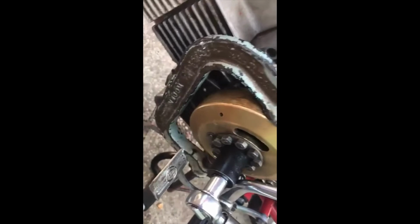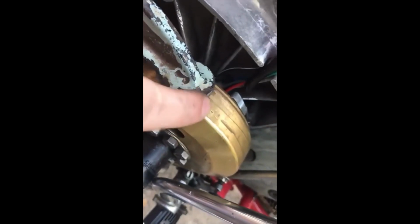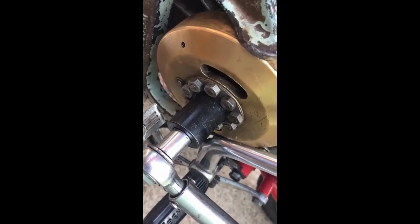Right, I'm tightening the flywheel up. I've got my torque wrench on there. It's set to 55 foot-pounds, and the method I use is I put a G-clamp on the flywheel, and then where the leg of the G-clamp comes down there, this bar is jamming it there so that this can't rotate, and then I can tighten the flywheel up. I find these G-clamps are really good for clamping the flywheels. You don't have to tighten them up, all you have to do is nip them up, and when you try and turn it, it jams. Doesn't damage the flywheel. Used it loads of times. So I'm now tightening it up at 55 foot-pounds, and then I'll run it and then try it again, because it's important that this is tight, because if it slips you can wreck the taper. It'll shear the woodruff key and wreck the taper, so it is important that this is correct settings.